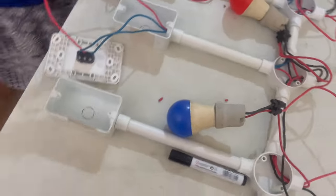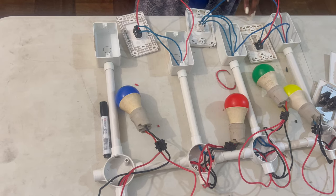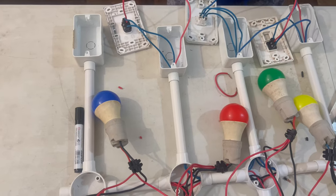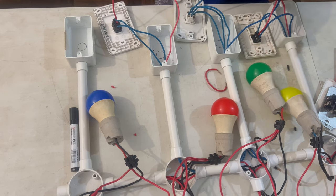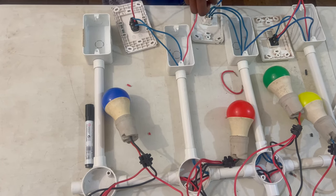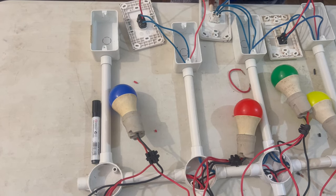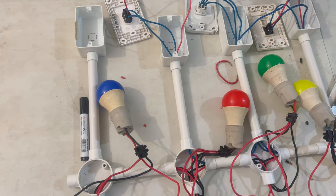I've already connected everything here. This is the first one, this is the second one, and this is the third one. As shown in the diagram: three pins, four pins, and three pins. The middle one from the first switch comes from the DP here. This one comes to the second switch, and the blue ones from the third switch are coming here on the second switch again. This is the positive of the light going straight to the light.